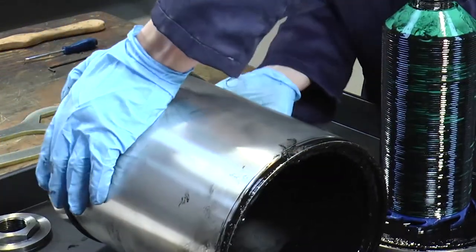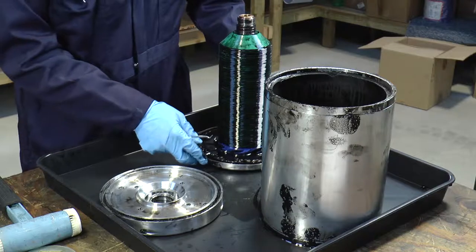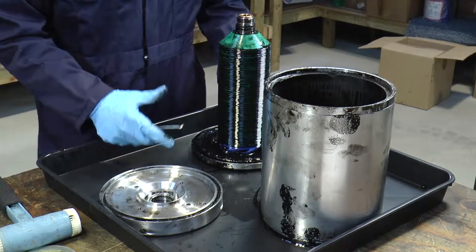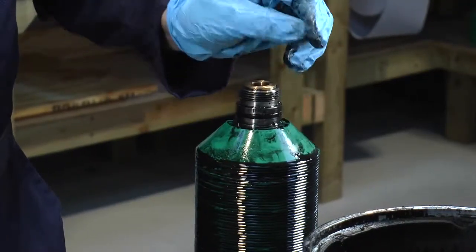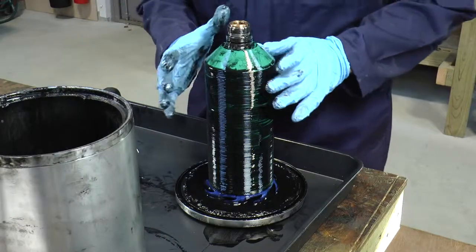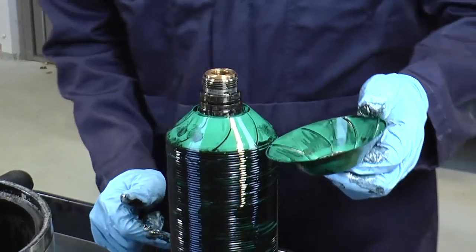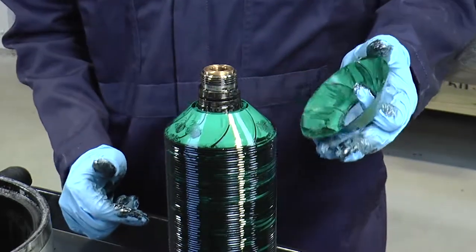We can then remove the top turbine — it comes in three different sections. Now we've got the distributor plate with the bowl discs and bearing tube open. We don't need to actually clean the bowl discs as they're designed so that sludge doesn't stick onto them. But check the O-ring at the top — make sure there's no damage and it's not brittle, otherwise it will need replacing. If sludge does go into the bowl discs, you may need to remove them by sliding them off the top, then clean and wash using a Biogen Active product, making sure not to use anything abrasive which can damage the smooth surface of the bowl discs.